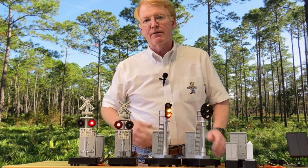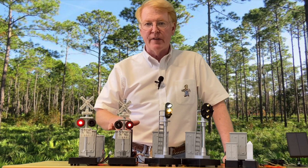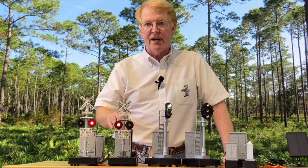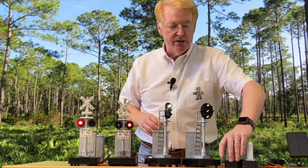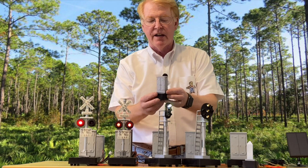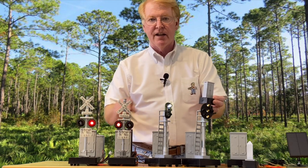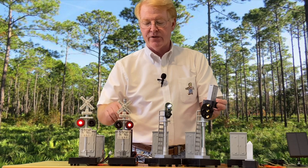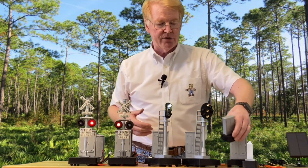One of the questions that came up from a number of potential customers — they liked the flasher, they liked the controller and understood that. They said, so the train comes from the east and trips the Precision Detector Max inside the controller. That's right — this is one of the sensors as well as the controller. What about traffic from the west side? The Precision Detector Max is also available in a smaller standalone form. This would be powered by the same power supply, and a single signal wire would connect to the detect side, so you can pick up east as well as west traffic to trip the flasher. You can run two flashers easily off of the single G-Controller, one on each side of the track.